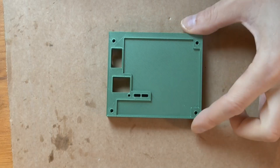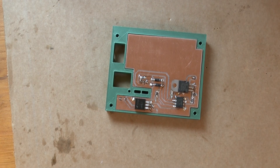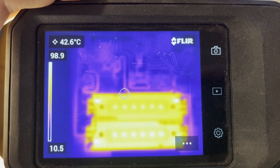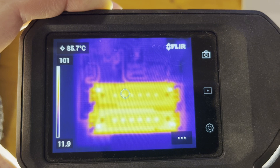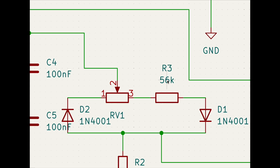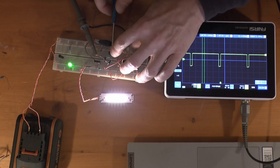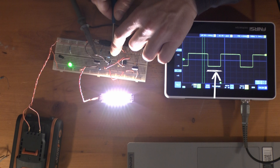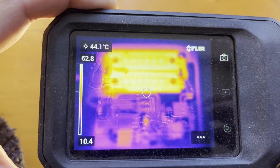On the new version of the housing, I have a fitting to put the PCB just right. But sooner than later I found a big problem — the LEDs are becoming a bit too hot. I have to do something about this, so I decided to change the circuit — just this resistor here. You're welcome to download the schematic and PCB design from my website. The purpose of changing that resistor is to limit the on-time of the power switch. The maximum brightness also decreases a little bit, but it's still pretty good. It doesn't get hotter than 60 degrees Celsius now, so it looks good to me.